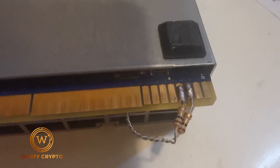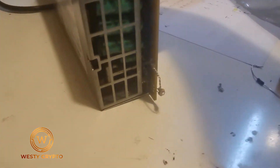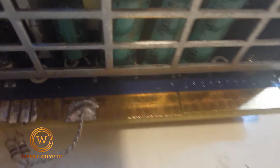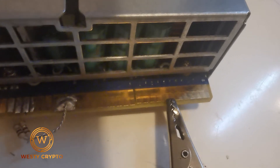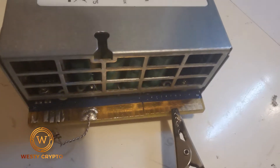Then just go to the earth bar, which is this one here — I've done it on the other side. The earth bar runs on both sides and you can see the joining piece between the two. This one here is the negative, and this one here is your main 12 volt bus bar that you want to start soldering all your gear onto.